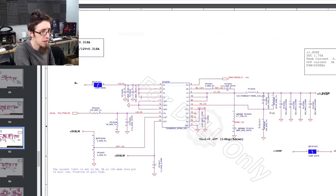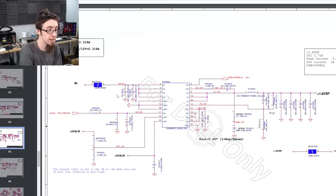So we've got two capacitors on the input here. Here we go, B plus. That's the main power rail coming into the laptop. So the main power rail into the laptop, there's two bypass capacitors, and then we go into the chip. And if you look, we've got 1, 2, 3, 4 pins on the chip which count as this power input. And that tallies with the big old trace that we saw on top of the chip. So these two capacitors here, these are going to be our guides. These are the ones that we're looking at. So let's zoom in on those.